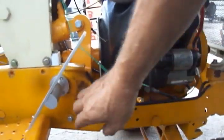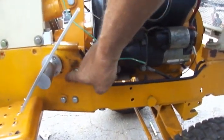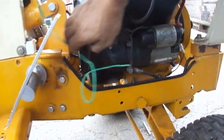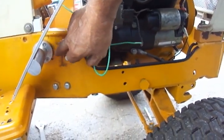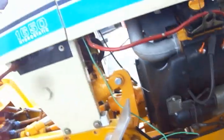Let's see if I can get this thing. I've got to add another bolt right here somewhere. I only got 3, and that part right there kind of twists a little bit because there isn't a bolt there because my hydrostat's in the way. I didn't have it when I put my hydrostat on here, so I didn't think anything about it. It's the reason why that's that way. So I'm going to come over a little further over here and drill another hole, which makes no difference.